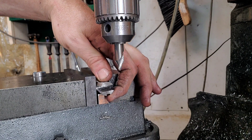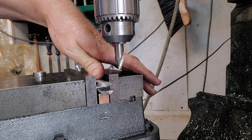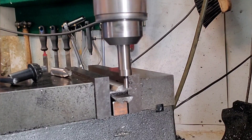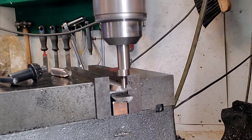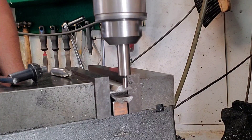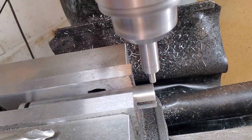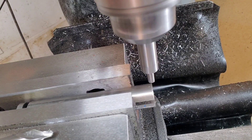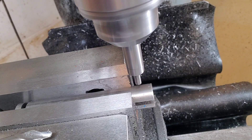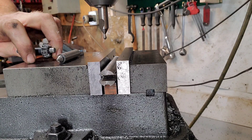I missed cutting the actual recess for the bearing on camera and I have to apologize for that, but we'll move on to the next step — center drilling and actually putting that dowel in to hold it. Here's one of my other favorite tools, the edge finder. I think this was like $35 and it is a fantastic life saver. Basically, you slowly run this up to the edge of the metal, it walks up, then you relieve it until it walks back down and lines up. You zero it, lift it up, and because it's 200 thou round, you move it over 100 thou to give you the center of the edge. Then it's just a matter of moving over 350 thou or whatever you need and you're bang on the money.